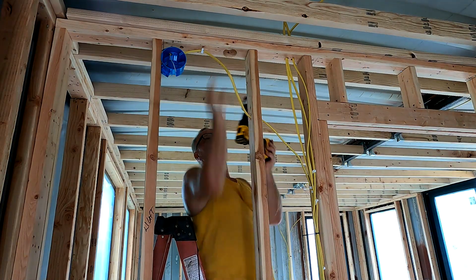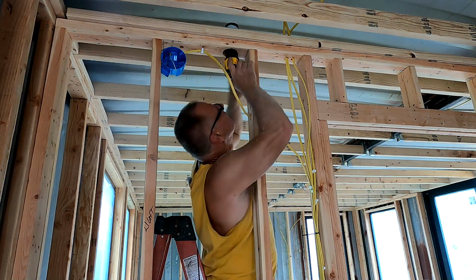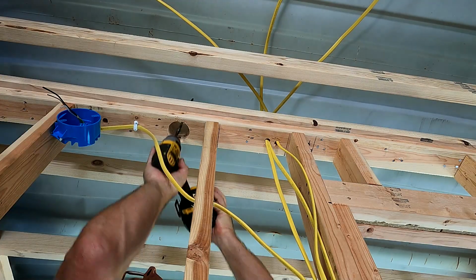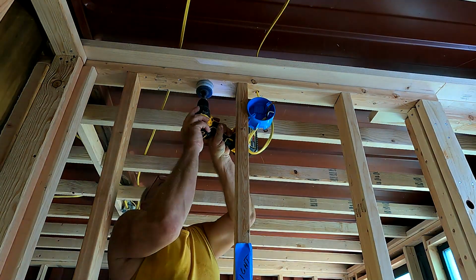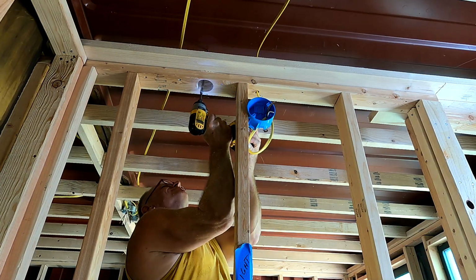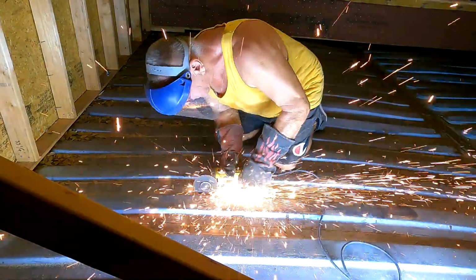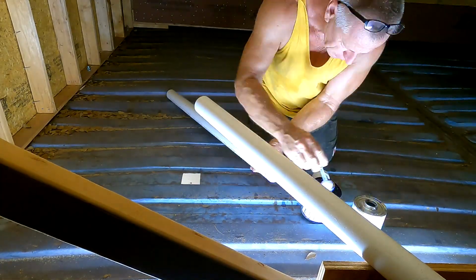So once I got most of the main line kind of figured out, I started working on the venting from the sinks and other areas connected to the main line, so the venting system works. Here this is just a vent on the other side of the apartment wall. Here's the one in the shared bathroom. And in a second you'll see me cutting holes in the container itself so the PVC can go through it. Basically I went upstairs, just cut a square hole for a round object, no big deal. Just big enough so that the pipe can go in, and continued along my merry way.